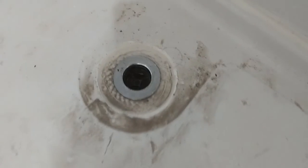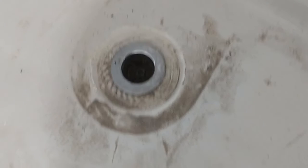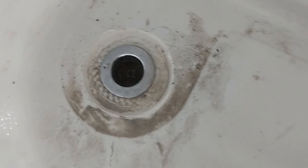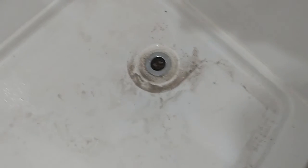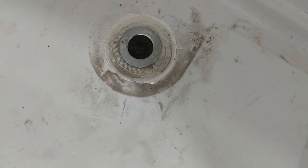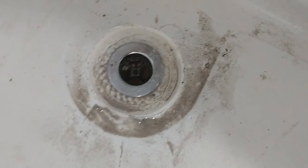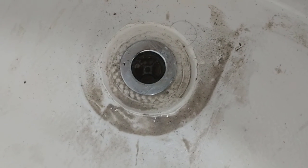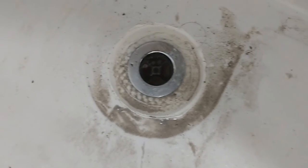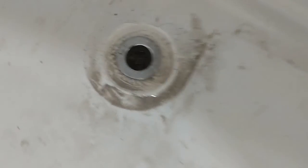And here is the end result of the drain adapters that we made. We put the adapters, the 2 circles cut out of PVC material, and we installed it, and then we used a marine grade type of glue to seal it. It's like an epoxy, and it's a marine grade type deal that's used on boats to seal water out. So it's good quality stuff. You then glue that in there, and then you seal it, and then you just screw that drain in there. So you don't have to convert the 1.5 to 2 inch or 3 inch or whatnot. You just build the adapters out of PVC stuff.